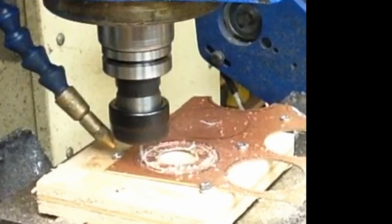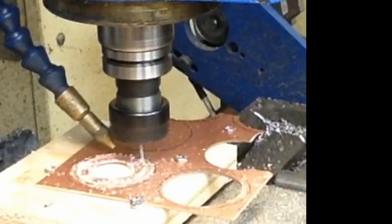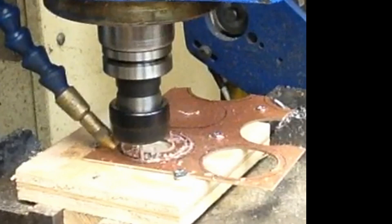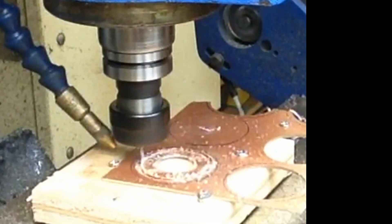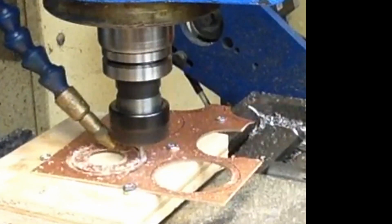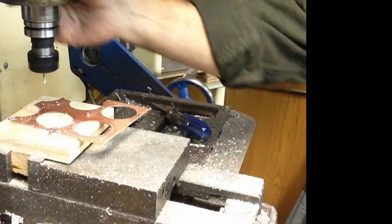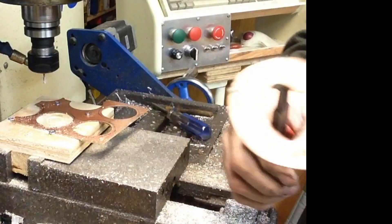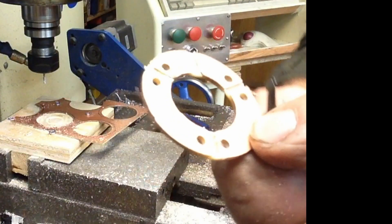There's not really anything that's critical about the outer cut — it has to set down in the probe body and not make contact with the outer shell, so it's going to be isolated so that it doesn't ground itself and short it out. Once it's done, here's a close-up of the circuit board itself — still got to be cleaned up, there's some copper torn on the edges, but otherwise it's quick and simple. Here's the completed circuit board — I cut three of these, I'm using two. We just clean those edges up, sand them down with a little piece of sandpaper and it's a done deal.